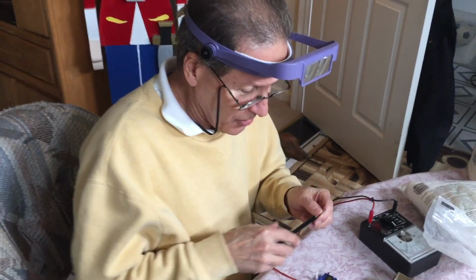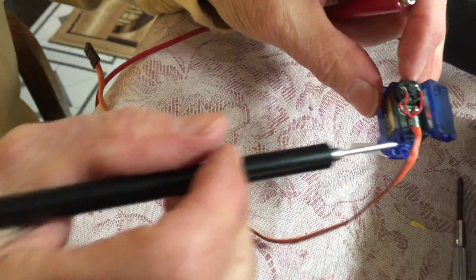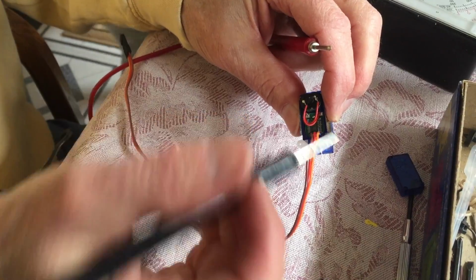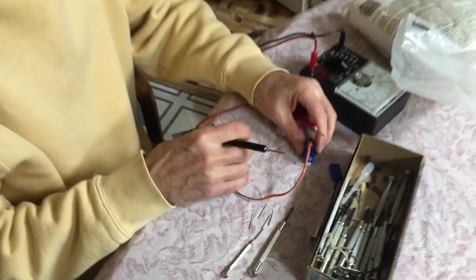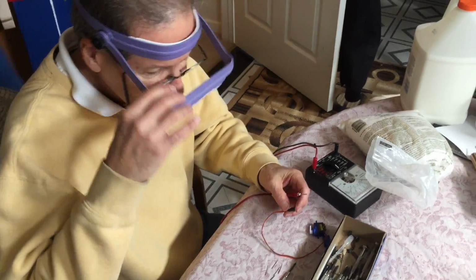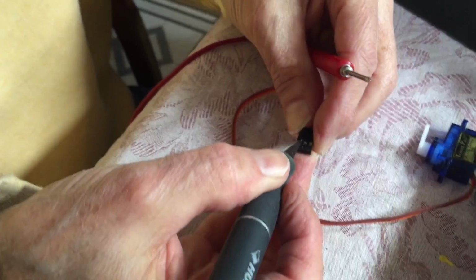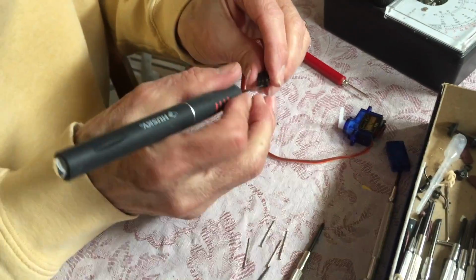Wow, what are you doing under the table in there? Is there an issue going on? Yeah, we've got some bad servos, and I'm checking the servo to see where the breakdown is. So you think we actually have bad servos? Yeah, and is that one right there? I've actually got it open, and these are all connected. I did find one on another servo where the lead actually wasn't even connected, coming from the factory. So I'm thinking maybe these pins down here aren't correct. Let's take a quick look. We're just going to pry this little piece up, and this here's the plug-in, and for some reason it's breaking down. I'm suspecting that down at this end, maybe these aren't crimped on correctly.